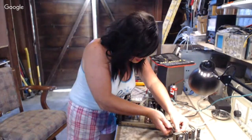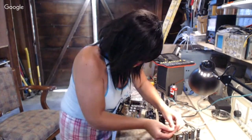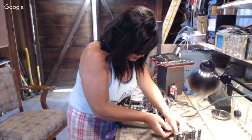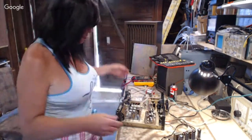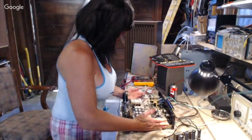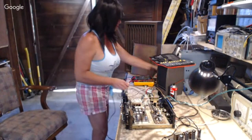Gotta be very careful we don't short out these speakers. And let's get the last hooked up here. Now we're gonna be using this little amplifier, taking the input from the tuner, this Pioneer tuner. And God, if this tuner comes to life, it's probably the first time in 20 years it's come to life. So what we're going to do is put it on what's called the variac, so we can bring the power up to it very slowly and safely, because I don't want anything blowing up or smoking out here.